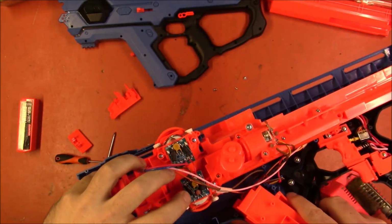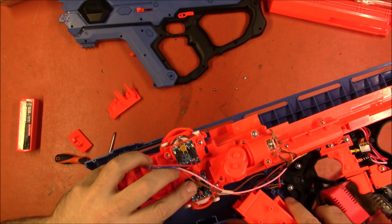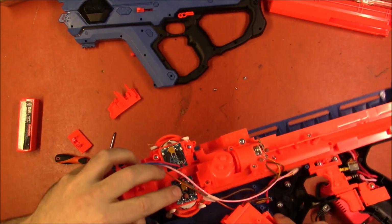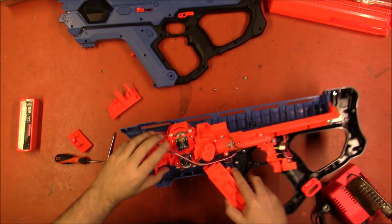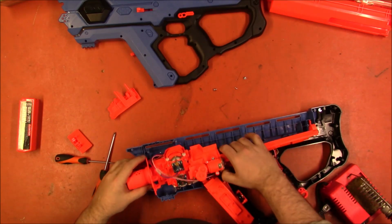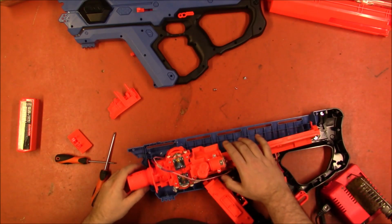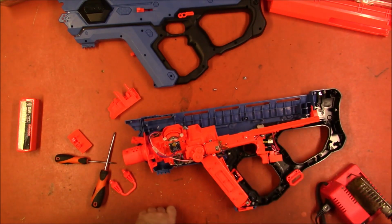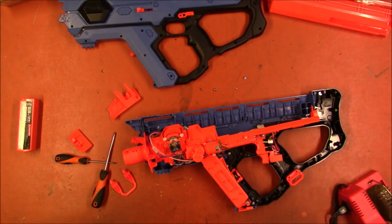You can see it's got a hole in it, and it's not connected to the motor post at all. It might have worked for a little while when it was pushed down, but after time it probably got wiggled just enough loose to no longer be making contact at all. So all we're going to have to do is fix that one solder joint, and we are good to go. I like it when it's simple. Probably turn on the soldering iron.